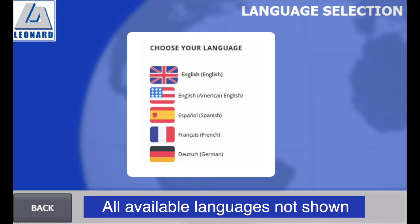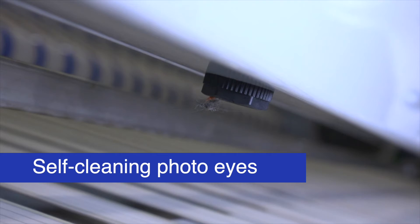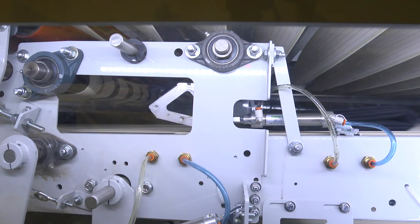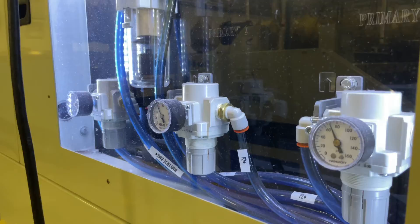There's also the option to add multiple languages. The LF and LFC series has an air-assisted self-cleaning function on all of its photoeyes. The series was designed with maintenance in mind, with removable side panels and access doors across the front of the machine. Work areas such as the cross-fold bed and the control panels are lit with LED lights to make observation that much easier.